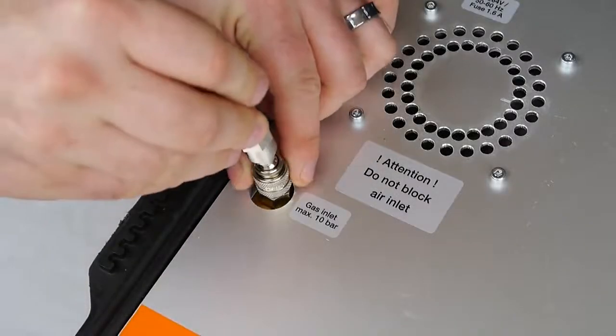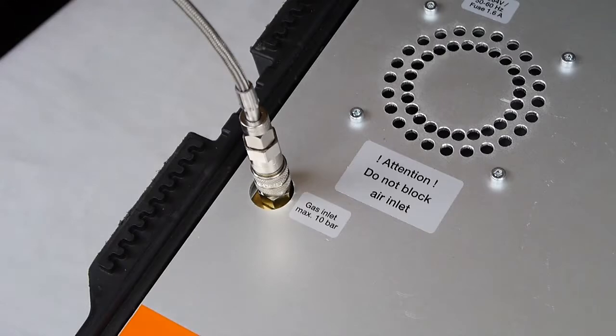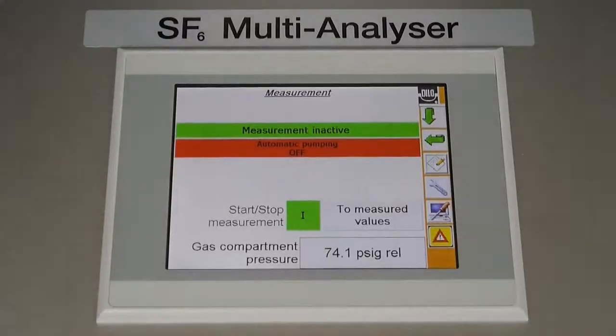When you're ready to test, simply connect the hose to your equipment. If applicable, connect the discharge recovery bag to your gas output port and select the green start icon on the main display. If dealing with a pressure higher than 130 PSIG, the use of a pressure reducer is necessary. Once the test has started, you will instantly hear the hose purge function, which is displayed on the status bar, and a completion percentage indicator will also appear. After the purge, the SO2 sensor will receive a sample to test before opening the rest of the device to gas flow. This is done to ensure highly contaminated gas has no chance of harming any other internal components.